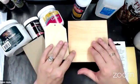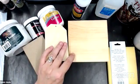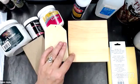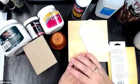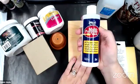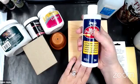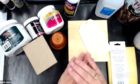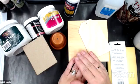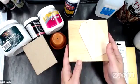The pine, when you put the Multi-Purpose Sealer over it, will raise the grain, and then you will have to sand it to get it smooth again. Now, if you want to expedite your painting, I would suggest mixing the sealer with your base coat color. You can mix it with any of the DecoArt Americana acrylic paints and get one coat of color on there at the same time that you're sealing it. You still have to sand it, but the next time you put a layer on, you can go straight to the paint.